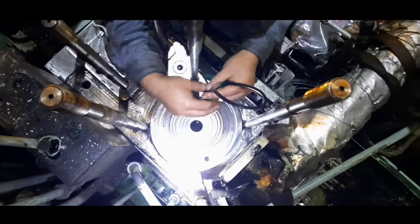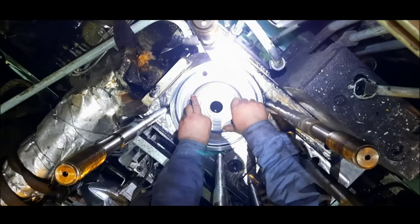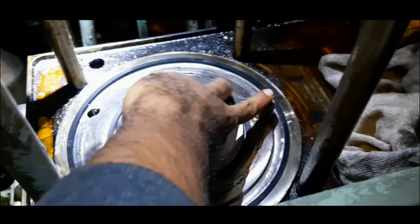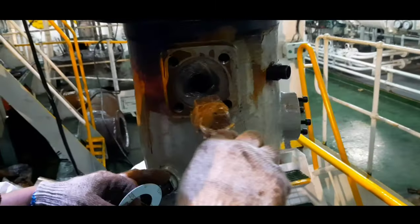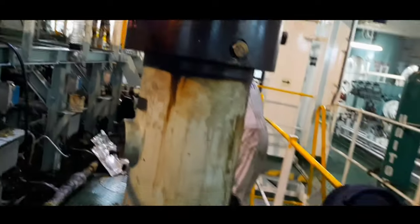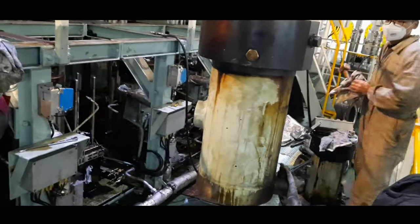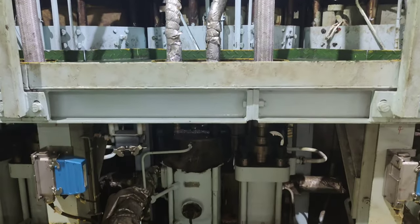Next, mount the two new sealing rings at the base of the fuel pump. Also, replace the two O-rings on the drain oil bushing. The fuel pump is now ready to be installed back on the hydraulic cylinder unit. In my next video, I'll be explaining in detail the mounting procedures for an overhauled fuel pump.